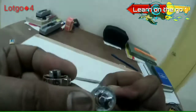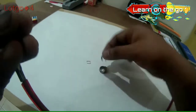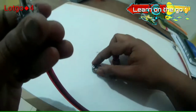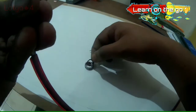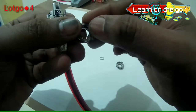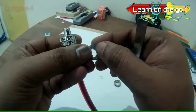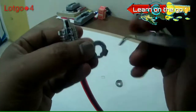The recess allows the key to pass. If it's at the correct position it will move; if it's at the wrong position it won't move. Likewise, the remaining barrels or dials are arranged with a spring to hold them in place, and the spring is aligned so the passage is along the passage of the barrel or dial itself.